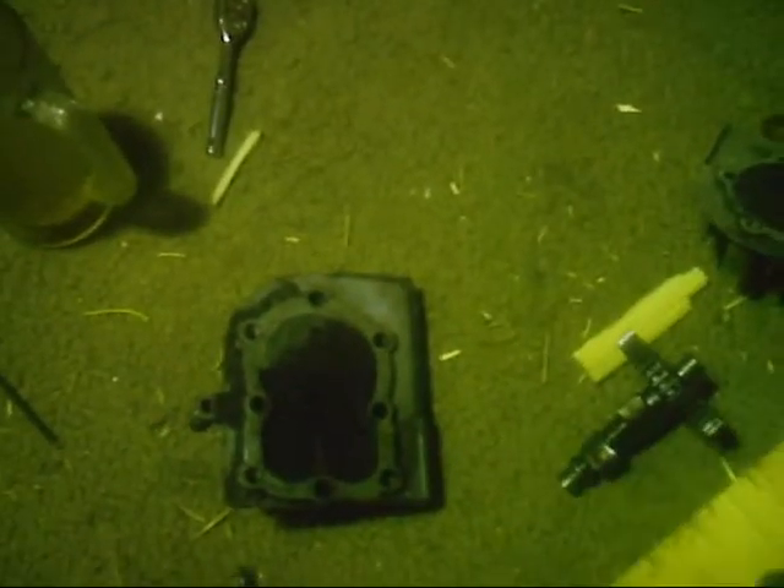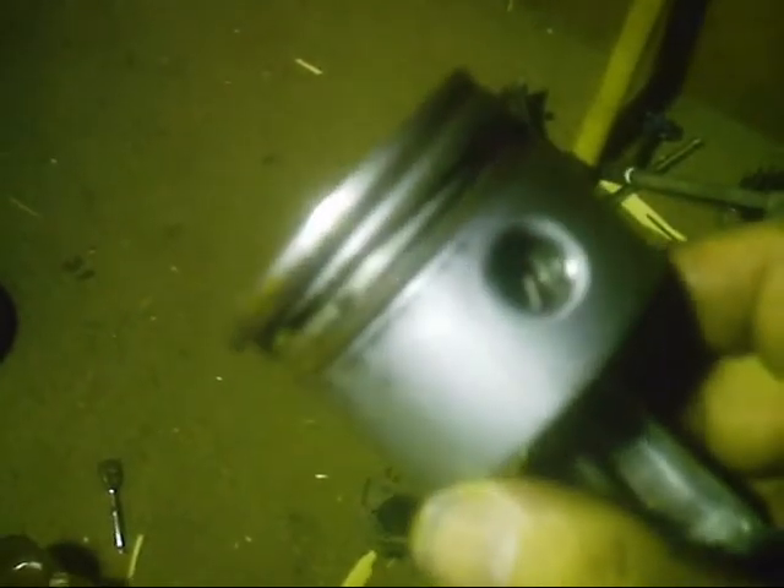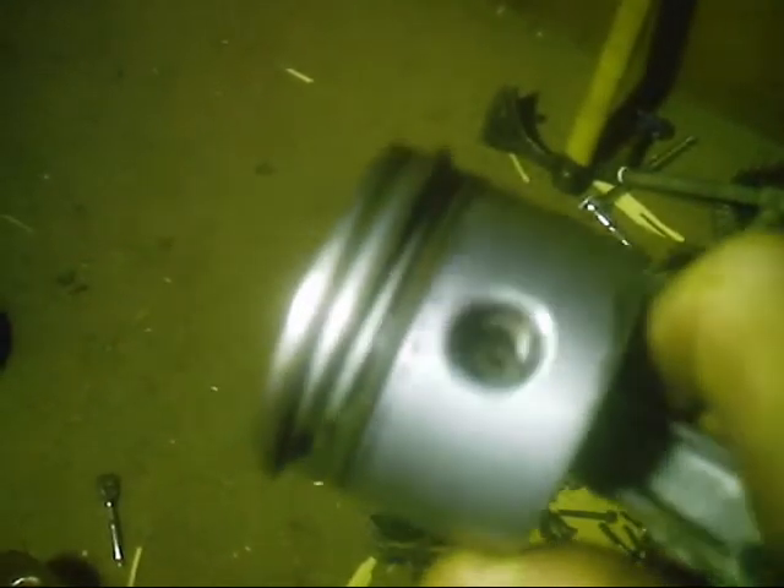Here's the next modification I did that I thought was most important. I'm going to get a piston here. You can see where the oil ring was — the oil scraper. I took the oil scraper out and filled the holes with electrical tape on the inside, then packed the ring slot with hemp string. That really seals up the cylinder well as far as blow-by is concerned. You don't have to worry about heat since it's a steam engine, and since it's hemp rope it will be durable enough — the rope seal of a main bearing on a 318 is made out of hemp, so that sets a little precedent on the durability.